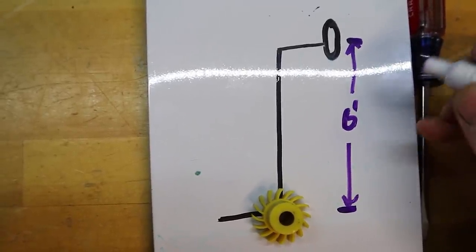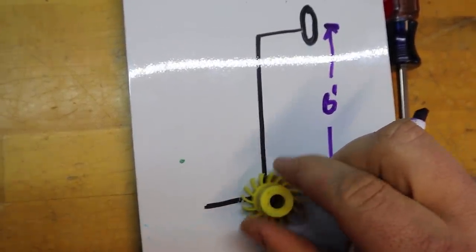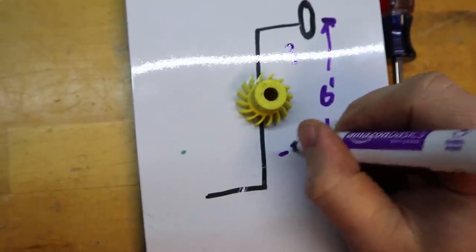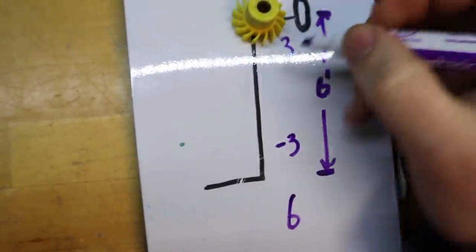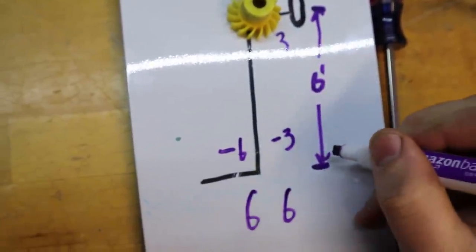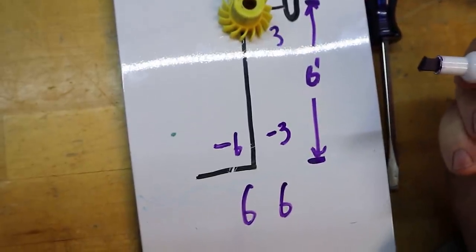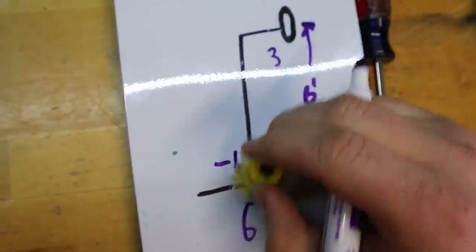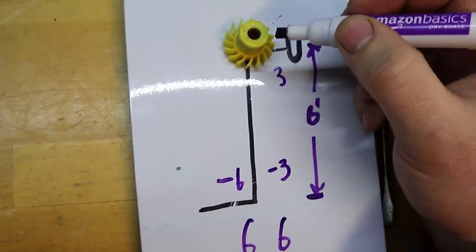A quick explanation of how this works: you might think that a turbine should go at the very bottom — it can, and you'd have six feet of pressure driving it. You could also put the turbine partway up and have three feet positive and negative three feet of pressure; add them up and you still get six. If you put it at the very top, you get minus six feet and the difference is still six. So no matter where you place it, as long as you have an airtight suction tube no more than about 30 feet — realistically about 20 feet — you have a functioning turbine. A turbine probably prefers to be at the top so it's not dealing with positive pressure through the bearings and seals.